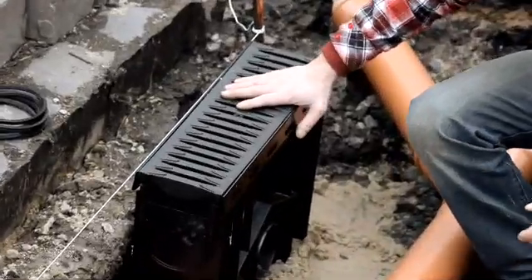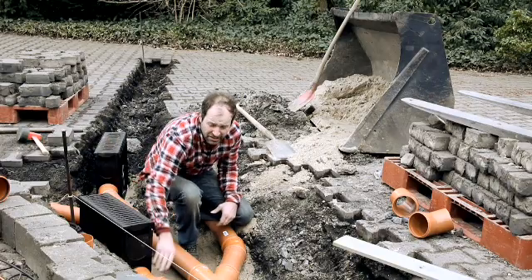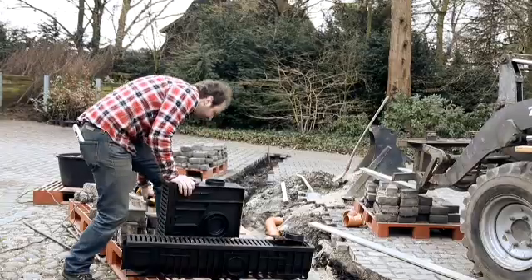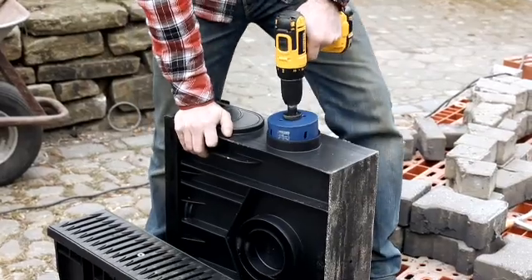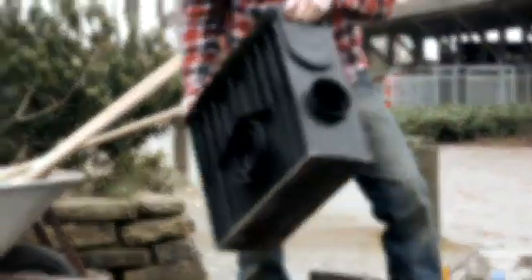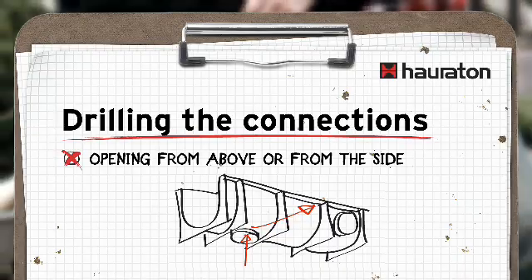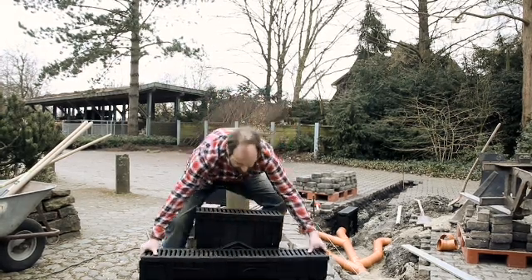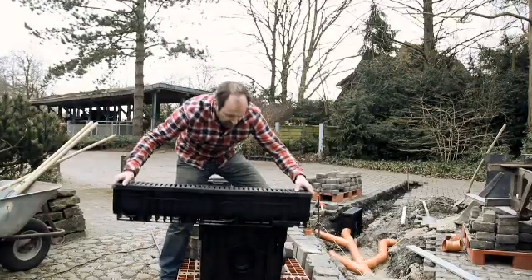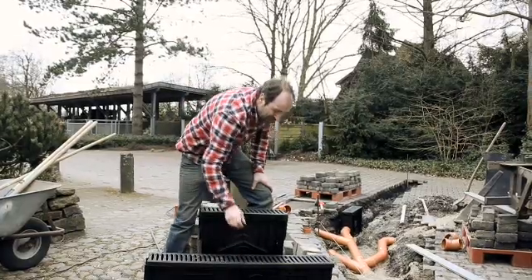Now comes the next step, which involves making the openings in the trash boxes with the drill. We have made the connection here temporarily, meaning we have only put it loosely in place and the trash box can be taken out again. We will then make the opening with the drill bit and position the channel in this direction. The trickiest things are the items that are underground, because they are no longer visible afterwards. We have now cut the opening. With Recifix Pro we can even go directly to the channel from below, from the side if necessary, or above the end caps as is the case with shallow installation depths — there we have the pre-shaped cutout. Now we can continue constructing the channel.